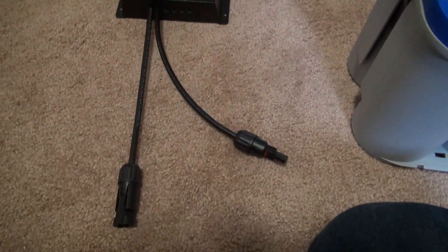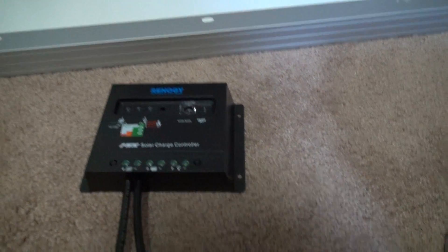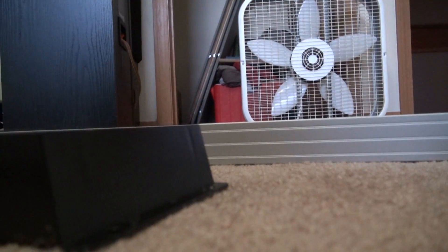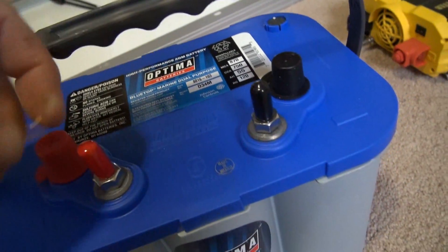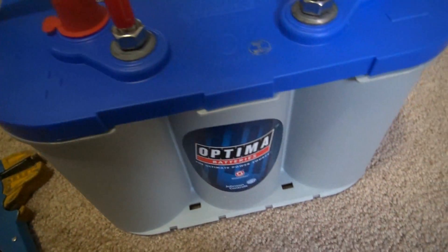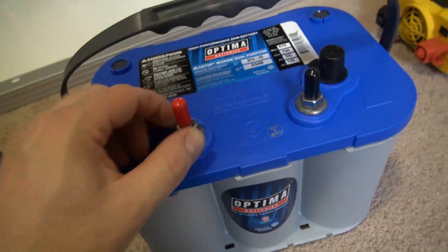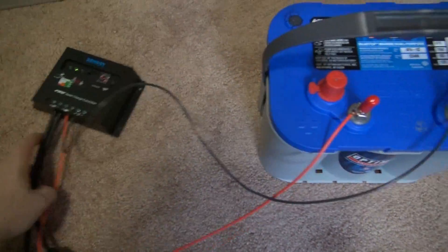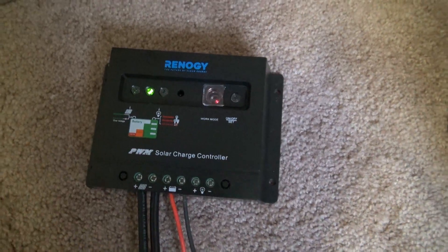We've got our pigtails hooked up. Now we're going to hook just some temporary wires from our charge controller to the battery. The way you do these connectors is you just loosen them all the way, which opens up the jaws inside. We slide the red wire for the positive side in and then tighten it back down. Then I'll take the other end and do a quick loosen on that nut, place it in, and snug it. That's just a good temporary connection, and we're going to do the same thing for the black wire. Now we've got the red and the black wire connected to our charge controller. As soon as I hooked that battery negative cable up, the green light came on, which indicates that my battery is charged. So far so good.